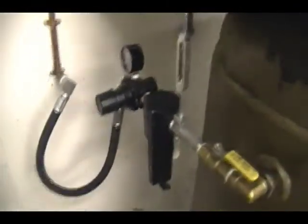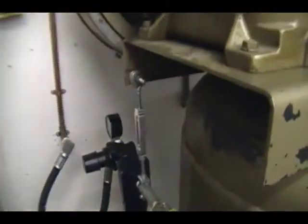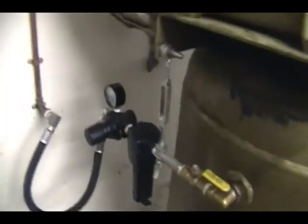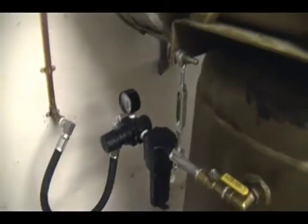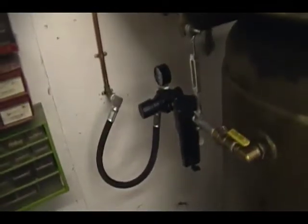That will be more than enough for what I need to do and for what he needs to do. My air sander requires 90 PSI, so I'll regulate that at the other side. He doesn't need more than 100 — actually doesn't even need that. We're both after volume, not pressure. I'm not running an impact wrench, so I don't need high pressure, and if I do I can always crank it up temporarily. That hose is definitely overkill, but it'll never fail.